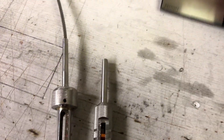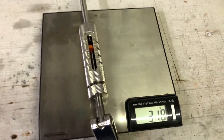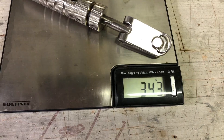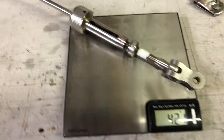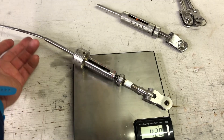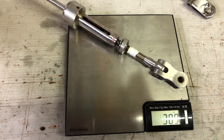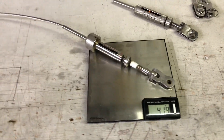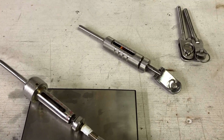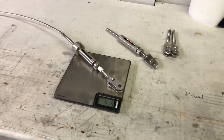To start with, let's throw them both on the scales. The PKM first weighs around the 340g mark — there you go, 343g. Unfortunately the only Brelga I have here is attached to an Etchells lower shroud, but I have weighed them previously and know they're around 400g. Taking the load of the wire off, it comes out very close to 400g. So roughly a 55g saving on the PKM — not a whole lot, but for four turnbuckles on an Etchells it's around 200g weight saving.